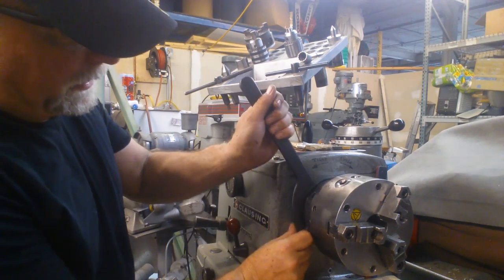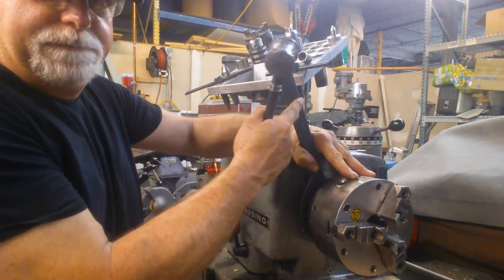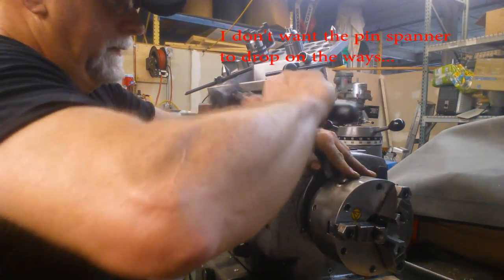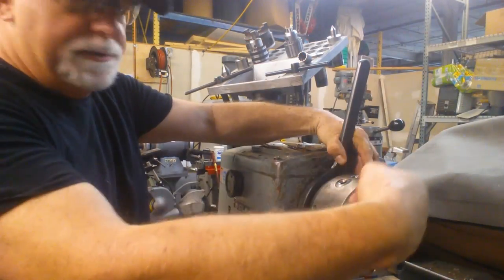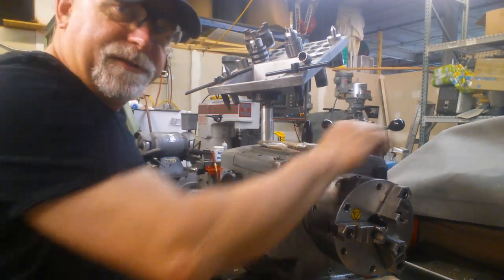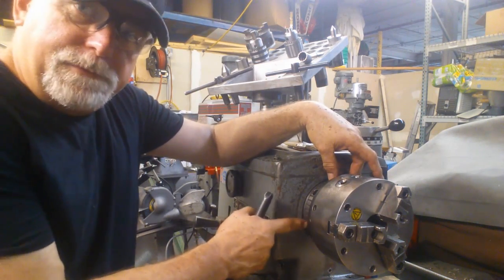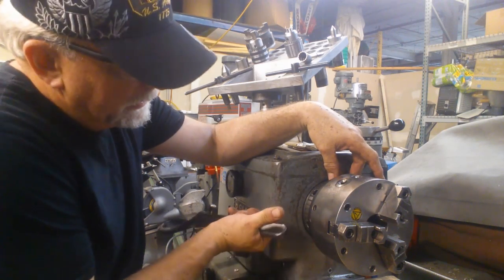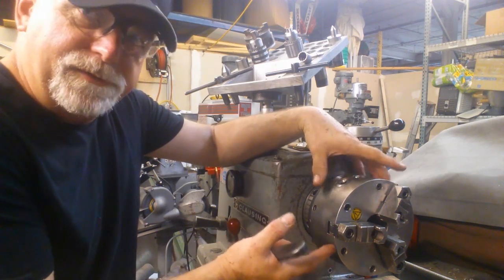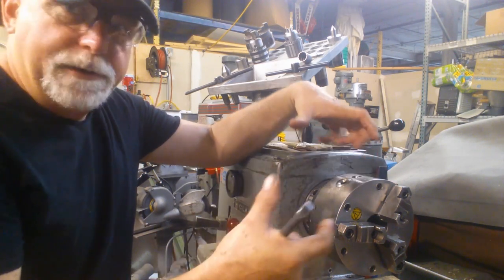We're going to lock the spindle, then you can put the wrench on. I'm hanging onto this pin spanner because it's going to want to go to the back of the machine. Clockwise — looking at it from this way — clockwise is going to pull this off. That's the first step of resistance. Now we're getting to the second step. What's happening here is the threads are pushing against the headstock and driving the threads on the chuck. That's a good thing, because we actually want to pull this tapered female chuck back plate off the tapered male spindle nose — they're driven together.